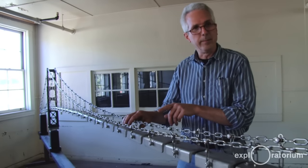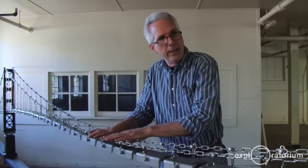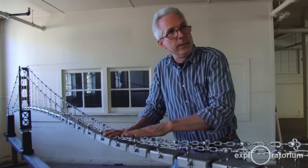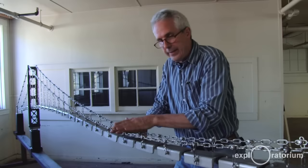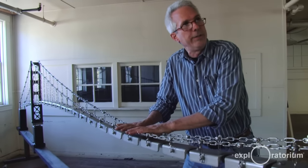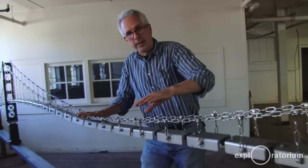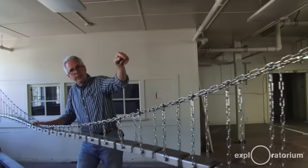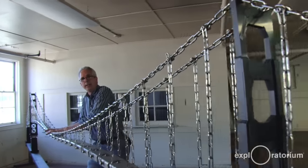This is the fundamental of the vertical mode and it's inherent in the suspension bridge design. If I push down on it, what will happen is that you distort the main cables into this V shape here. It only goes so far before the cables completely straighten up, from here to the tower and then from the tower to the anchorage — and then it just won't distort anymore; now they're taking straight lines.